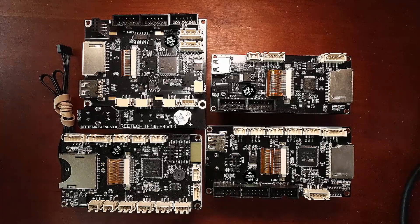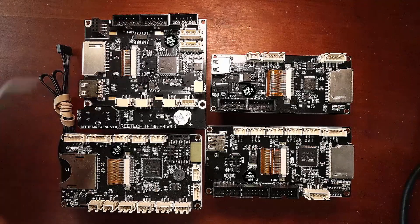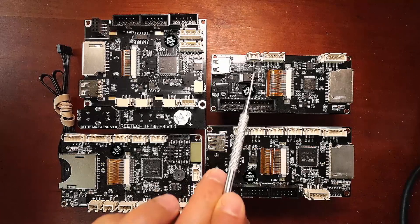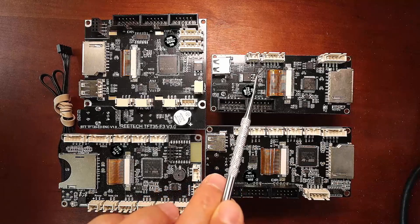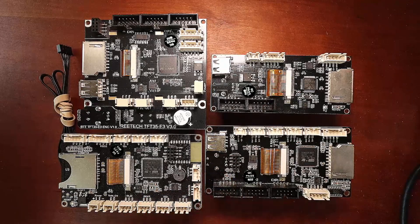The naming might be slightly different. For instance, the RS232 located over here — that is your TFT port. If you look at the other one just to the right, you can see there's a reset, a TX, an RX, a ground, and 5 volts. That may slightly vary between each one of your boards, but that's what you're looking for. Either one of those two names is what you're going to connect to for your TFT.